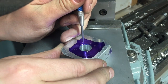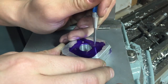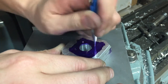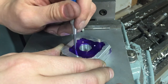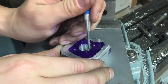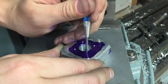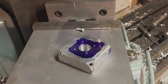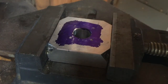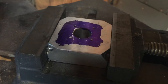I'll just give a little center punch for each of these. I'm putting a 6-32 screw into each of these holes, so I looked up which drill bit I need to use, and it's a number 36. I've got that all chucked up in my drill press, and I'll go ahead and drill those out now.